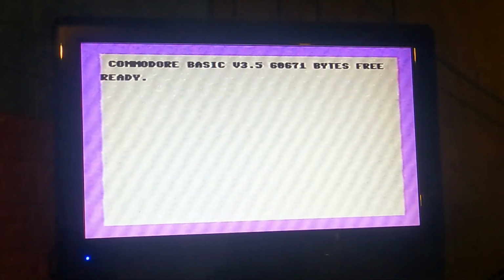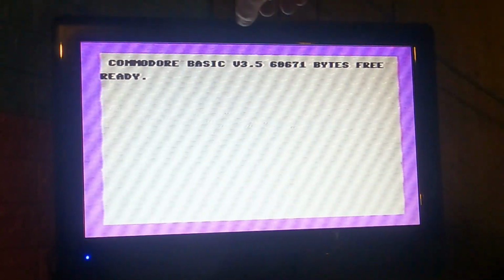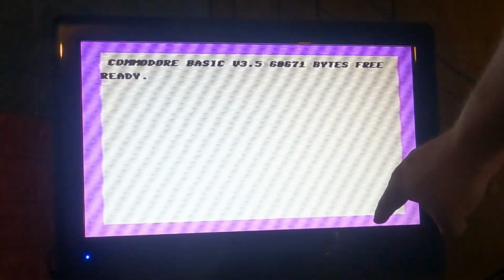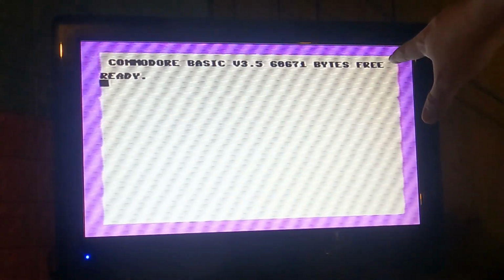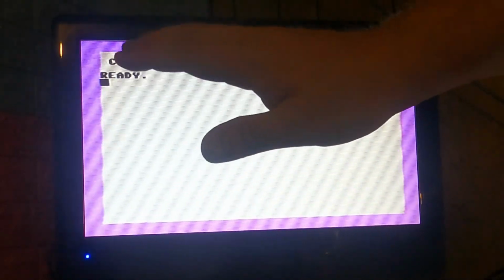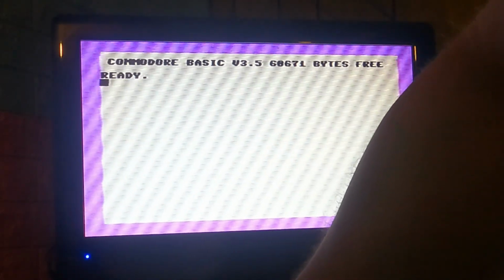Now, I have 64K of RAM available, but I still can't figure out what's up with the video output. This is on composite, so it's not losing sync on the RetroTink, but that still means I can't do direct capture to the computer yet. I've tried adjusting all the pots I can find, the 2 in the RF modulator and the 1 by the clock crystal, but all they do is change the pattern of the distortion. I haven't been able to remove it completely yet.